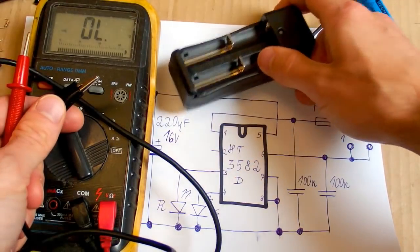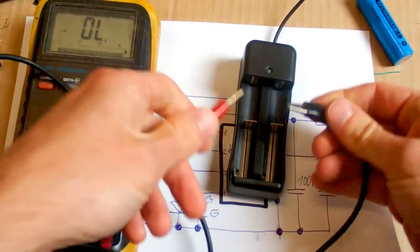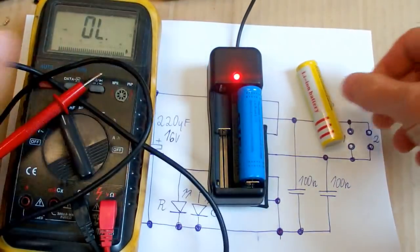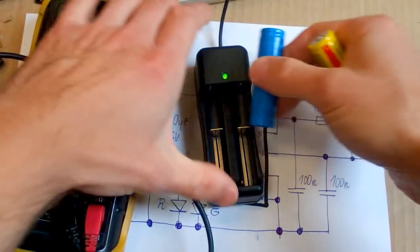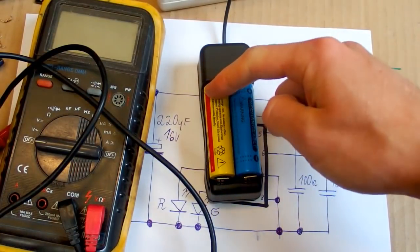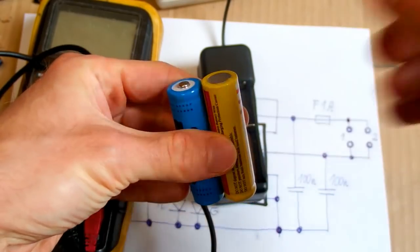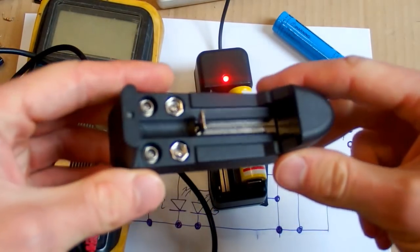This Chinese charger has one peculiarity: there are two charging slots but just one chip, so you are charging both batteries directly in parallel. I recommend you to charge just one battery at a time, because if you are charging two, you are halving the current. If the two batteries are in a different state of charge, there can be quite a high current going from one to another, which is unwanted. The polarity detection doesn't work with two batteries, so if you put them in opposite directions you cause a short circuit. It's better to use just one slot or use a single-slot charger instead.